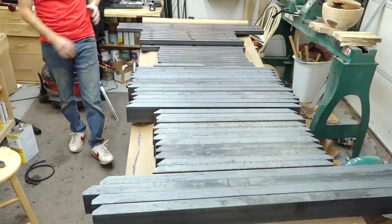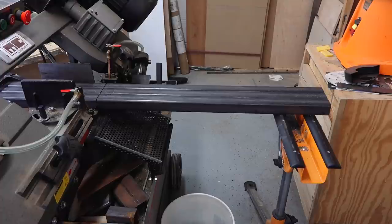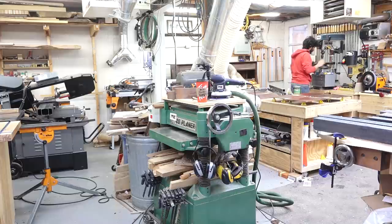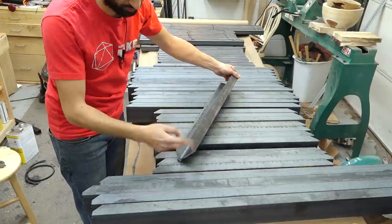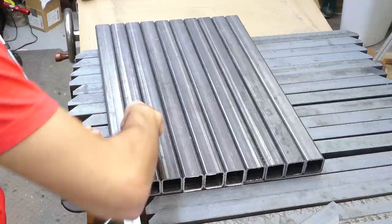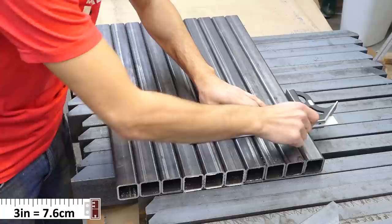With the drill press fixed, I can continue and get the holes drilled for the two-foot levelers. This is day two. Yesterday I was able to get all the pieces cut to length and most of the holes drilled, except for the two-foot levelers. It was really nice having the saw in the shop because as it was cutting everything, I was just drilling holes — really efficient and productive. All the base pieces have the corners nicely clipped. The layout for the two-foot levelers uses two leveling bolts, placed three inches in from each end.